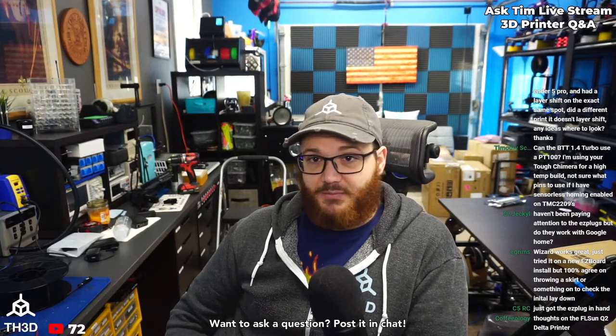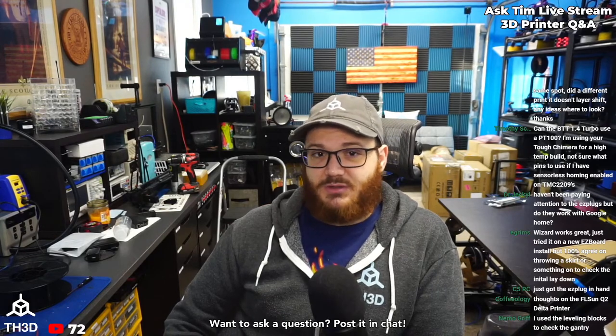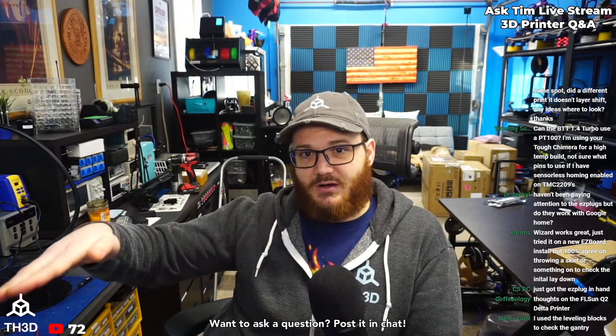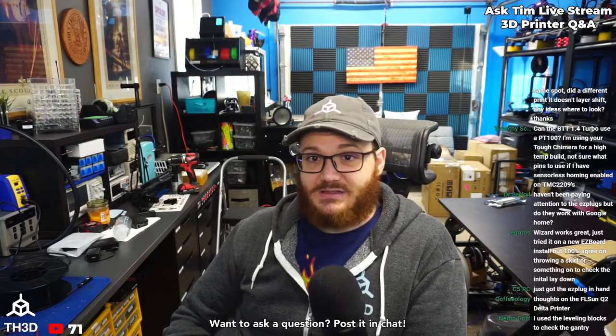If you have an Ender 3, there is a channel called The Edge of Tech, and he has an X gantry rework video, and he has a whole series on building that printer very well. That's based off of Luke Hatfield's help guide. Highly recommend checking that out. But usually there's actually an article in our help center. If you just search Easy ABL slanting, because usually people say, well, it's a slanted result, meaning you're closer on one side and higher on the other. That usually indicates a physical issue with your printer that mechanically needs to be addressed, because the software is assuming the bed is what needs correcting. It doesn't have the capability to compensate for other mechanical issues on your printer. It just levels your bed. That's it, or trams it, whatever you want to call it.